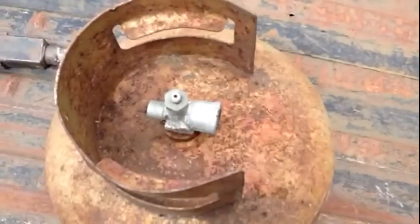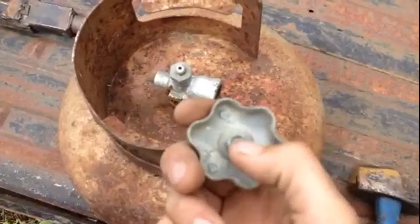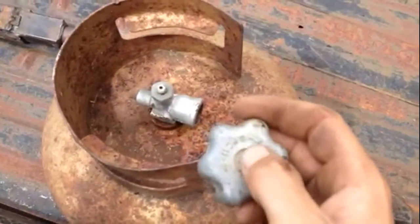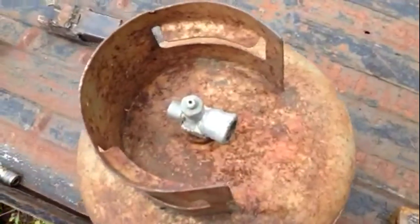You see that? I did that in one strike. One strike, and the screw comes out. The screw is made of steel. So you want the brass to be clean. There can't be very much steel in it at all, or it can't be any steel on it if you're going to recycle it for clean brass.